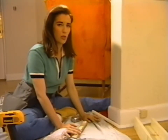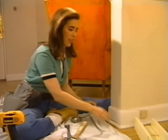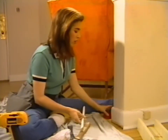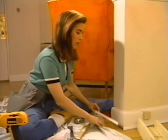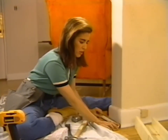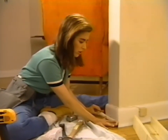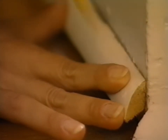It's really easy to cut the piece too short, and then you end up either with wads of caulking to fill up the space, or you just have to start all over again. So in order to avoid making that mistake, I'll show you two simple tricks to cutting a piece — these are called outside corners. To get the inside measurement, put the piece of baseboard a little bit higher on the wall, and now I can see this corner lines up perfectly with that inside edge.